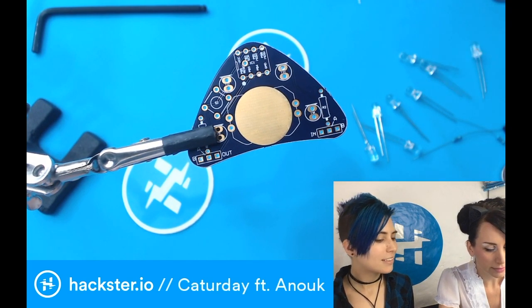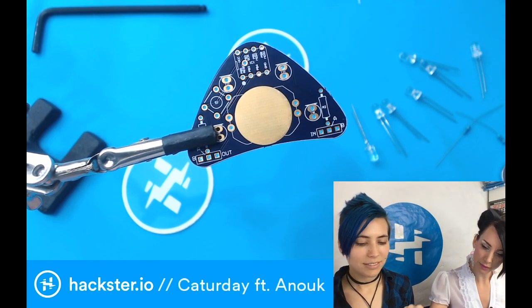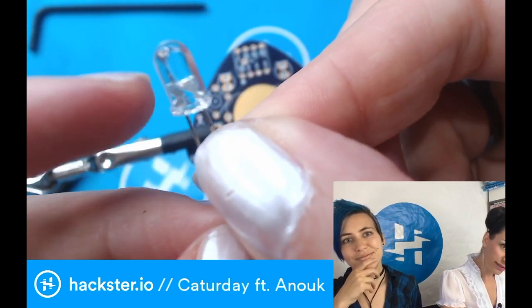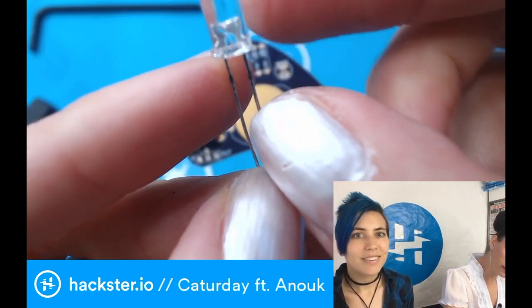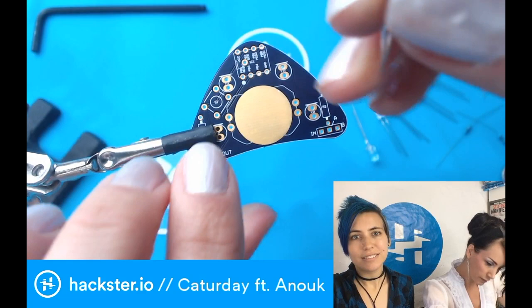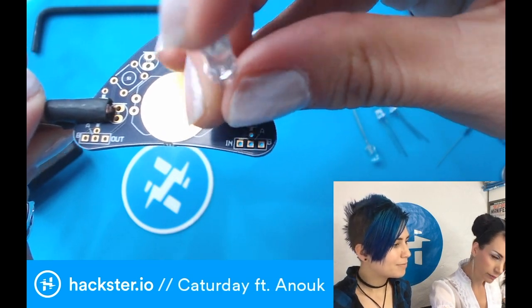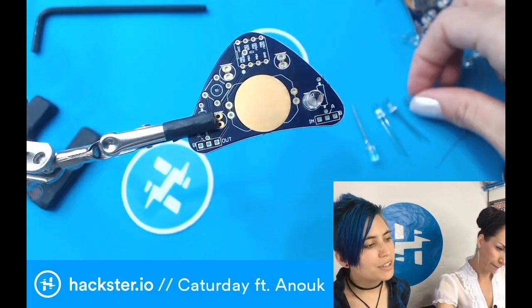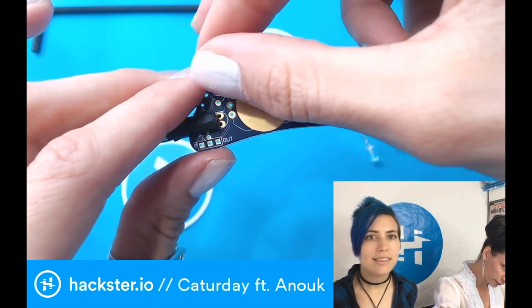What I mostly do is I stick the LEDs through it first. The LED has 2 sides when you look at it. Basically here you have the anode, that's your plus. And at the other side you have your cathode, that's the minus. So in the board, we want to place it with the anode at the left side, which is the longer leg. We're going to put them through. You can also tell which side is which because the ground side, the negative side, has a flat side on it, right? Yeah, correct. And you can also see this on the board itself.